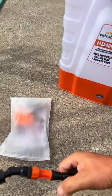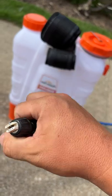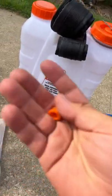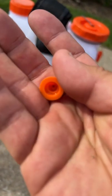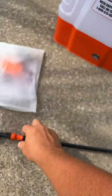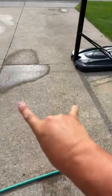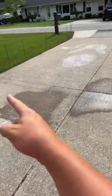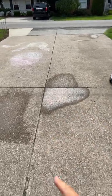The other thing I did was right here on that nozzle — I swapped it out with a real T-Jet nozzle instead of the nozzle that came with it. The original one's plastic and it really doesn't do much; it's just a hole. Whereas the T-Jet gives it even flow, even coverage, and good spray. The plastic one shoots out like a stream on one side and a stream on the other, with uneven coverage in the middle.